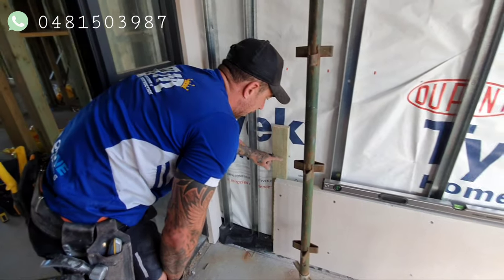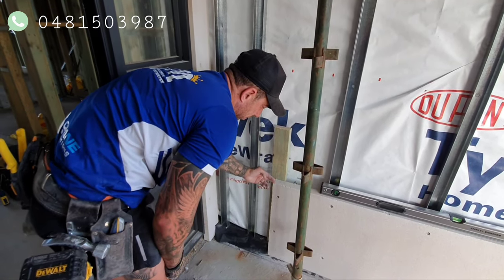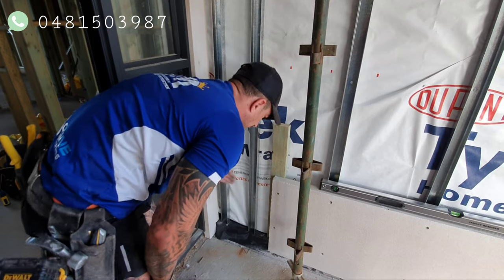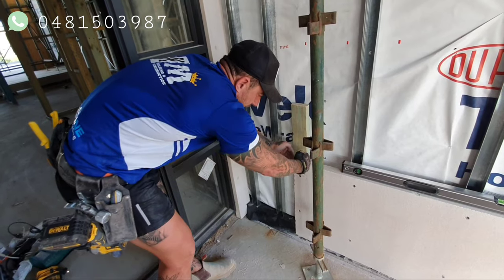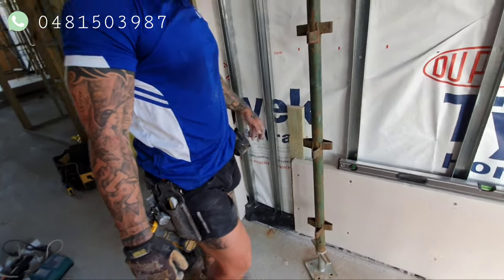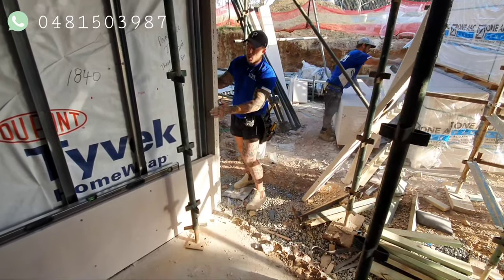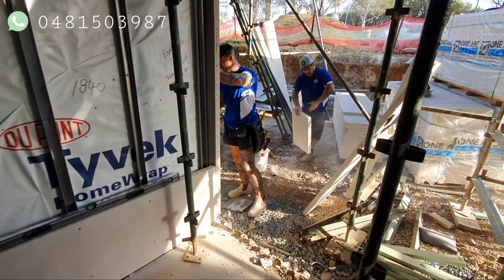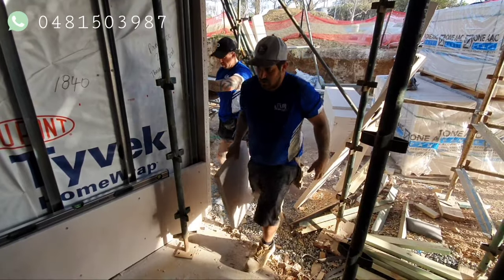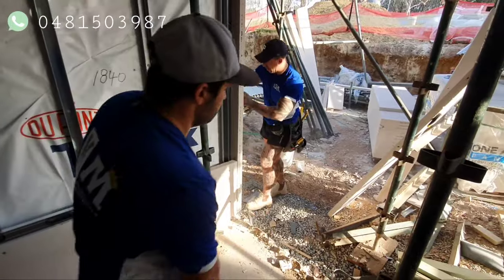We go straight down. I always like to hang it over the next one, so I put a screw in each corner. That way it pulls the middles in, and you don't have any overlapping the other ones. So we put the next panel on, we put another two screws there, and like I said, when this panel goes on, one rip right there, and it sucks it all together. Now I can adjust this one to where I need it. That's it.